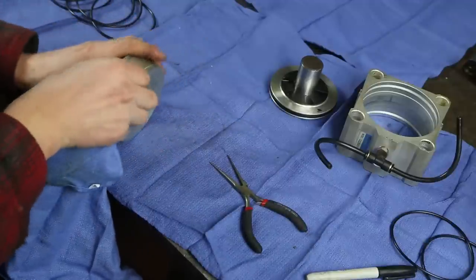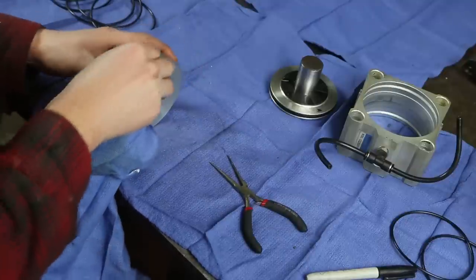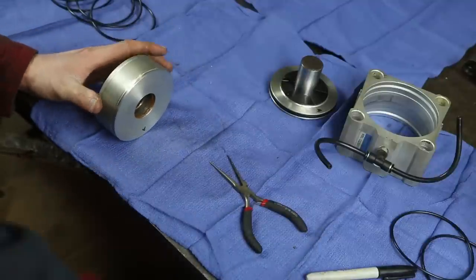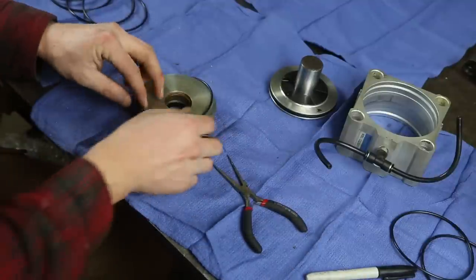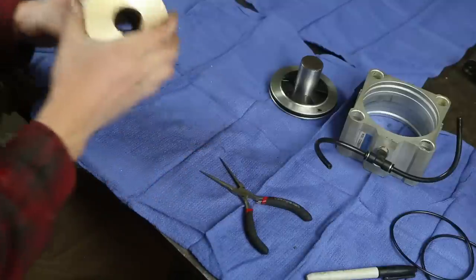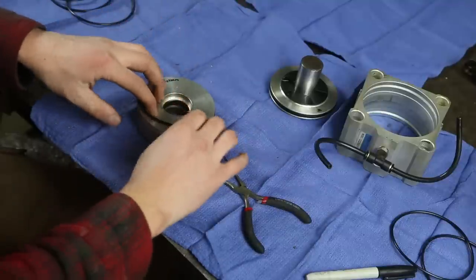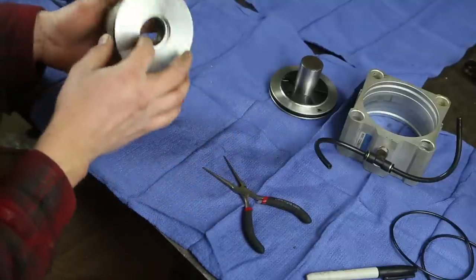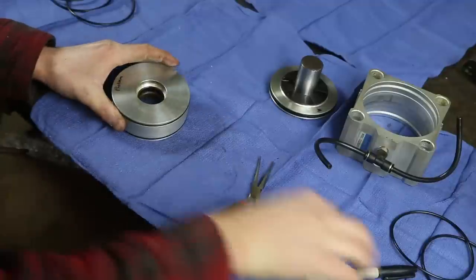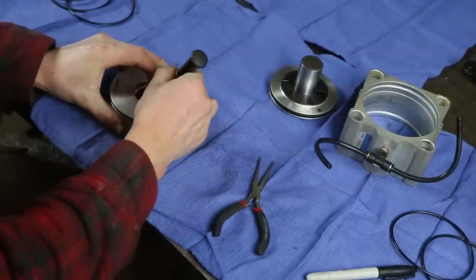These honestly feel good - I'm going to replace them but I'm going to keep the old ones too because I don't think those are in throw-out condition at all. What are you guys supposed to do? Obviously you want clean air coming into this thing, but I guess this power draw bar should have lubed air versus dry air. Honestly it's not something I focus a lot on. We don't run a lot of pneumatic tools that I know are supposed to have lubed air - although I guess I just answered my own question. Those are different in that they're incredibly high RPM or cyclic rate.